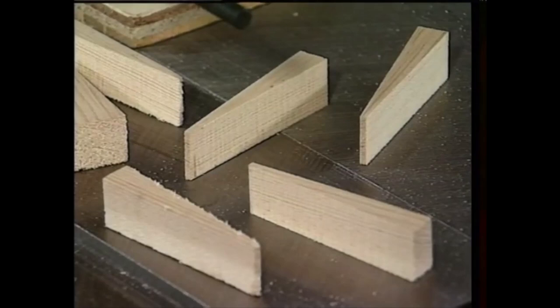Finally, a few words about blade breakage. It may be caused by cutting with a blade too wide for the radius of the cut, or it may be caused by a blunt blade. If blade breakage occurs frequently, one should investigate the possibility of guides being misaligned, the blade being cracked, or possibly fatigue if the blade has been used for a long time.